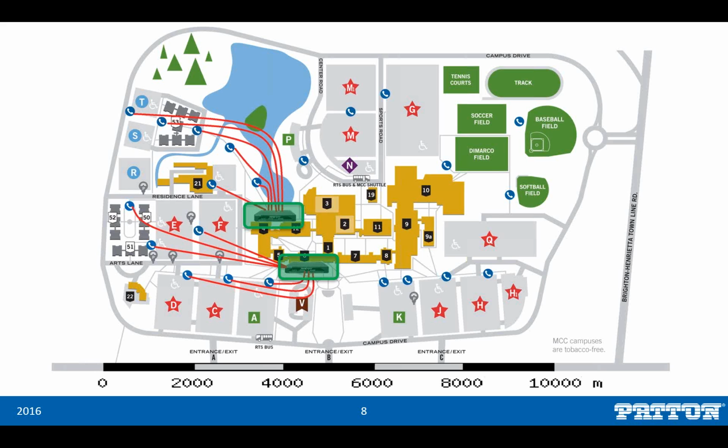Of course, there could be another approach in connecting those phones to an all IP environment. That would be to have an ATA at each of those phones. However, this would require power to be added to those sites, to every telephone actually, and also you would run into the problem of the max cable length of an Ethernet connection to provide the signal to the ATA, which is 100 meters maximum. However, with this solution here, you would have some kind of central location, you would have the smart node, which will be able to drive up to 8 phones, and each phone can be, as I said, as far as 6.2 miles.